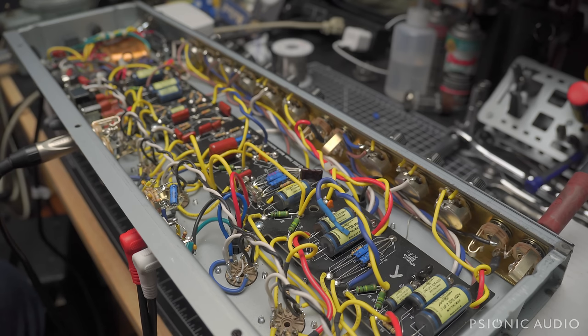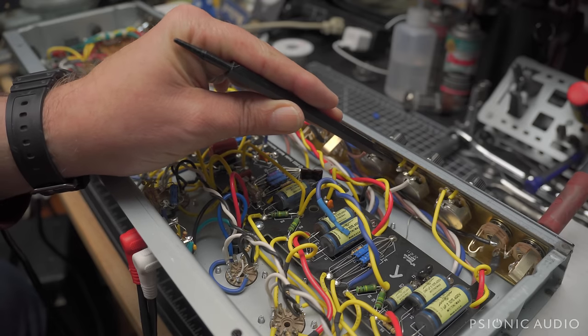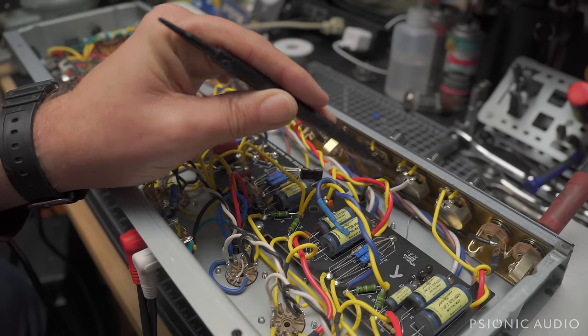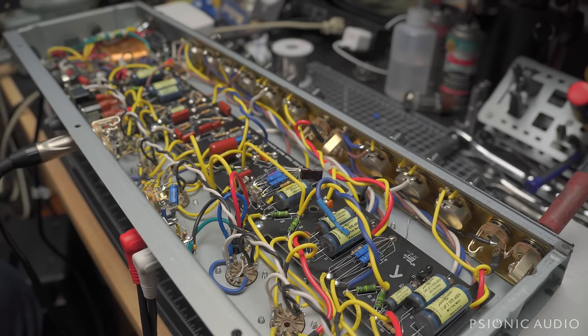All that makes a big difference for noise and reliability and it doesn't cost anything but a little bit of time. If you're not confident opening up an amp to do it yourself, take it to a tech — it won't cost much to have it done. You do need to open it up though, because if you just tighten a nut on a pot from the front panel you don't know if the pot is staying still back there or twisting around and breaking wires. For the price Fender charges you'd think they would have done it for you already — they did not.